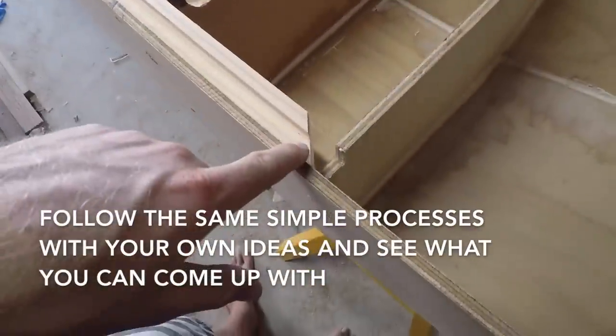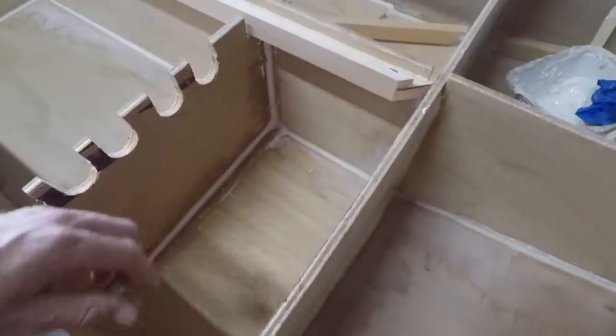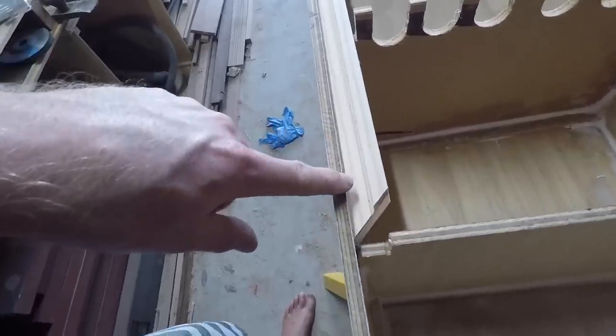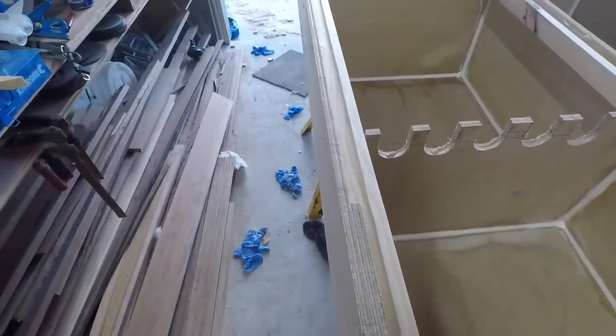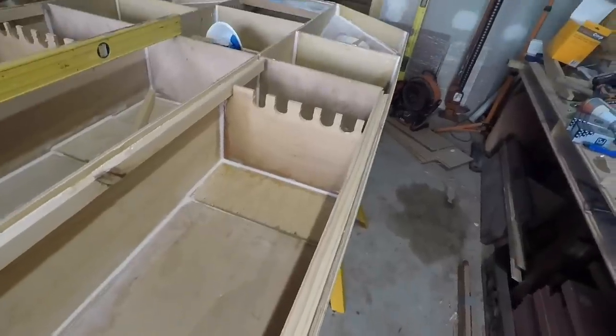We've done 45 degree angles on these things. So it's completely recessed and sealed all the way through. We did 20 mil by 10 mil. 10 mil down, 20 mil in. And we'll be running 10 mil taper on the bottom of the hatches, so we'll have a bit of play for open and shut on that. But we'll show you that when I start to build it all.